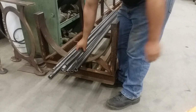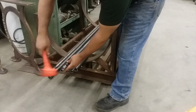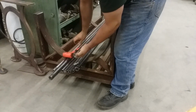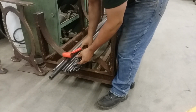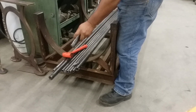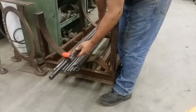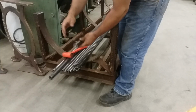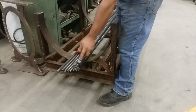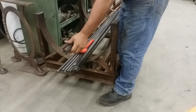Let me get the hammer. I made that groove so that this, there we go. That one's a little bit more stubborn. So now that I've got that slug in there, I can go ahead and puddle weld this, puddle weld that, and grind it smooth. And now I have a way to bolt my tables together with just a bolt, using a lightweight pipe. Here you can see one that's already been welded. So I just have to grind that smooth. And there is the insert.